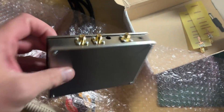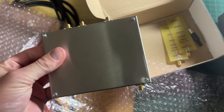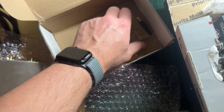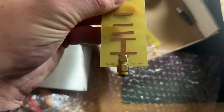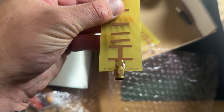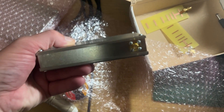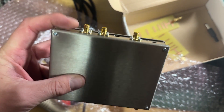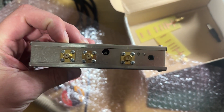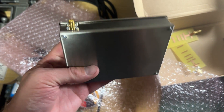Look what arrived today — it is the 5.7 GHz transverters. These are, I think, the first ones from SG Labs that have come out. We've got these little patch antennas — 5.760 gigahertz patch antennas. I think that's the 10 MHz reference input. And you've got your inputs for your IF and for your transmit and receive in and out, your power, PTT. I'm really excited — I want to get this on the back of the dish and get on the band.